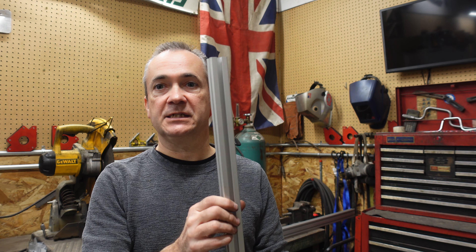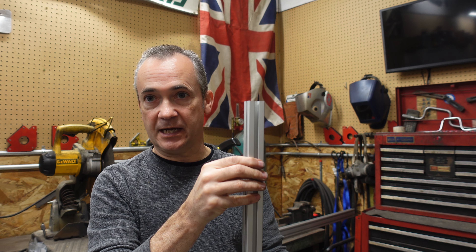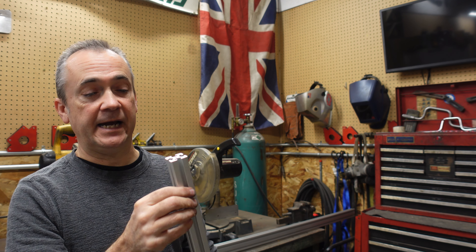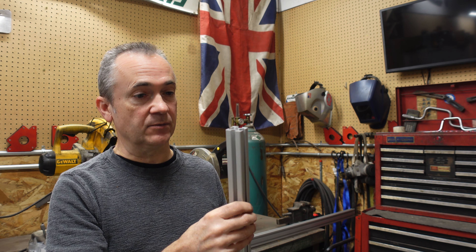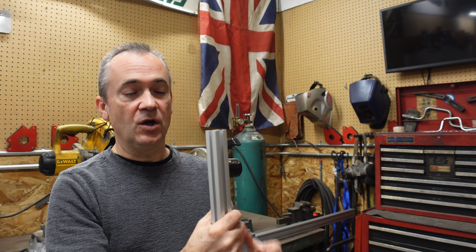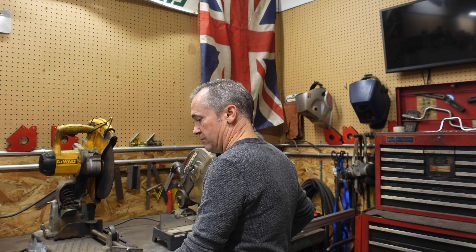They make all kinds of fasteners you can put into the slot — on angles, straight up and down, 90s, 45s — they make hinges and all kinds of stuff. In the past I've used one-by-one square tube aluminum, like what we used for the minivan bed build. This is the one-by-one slotted aluminum — same size but with the slots for modularity. Normally I'd drill it, put a flat brace in, and rivet and bond it; with this you stick fasteners in instead.